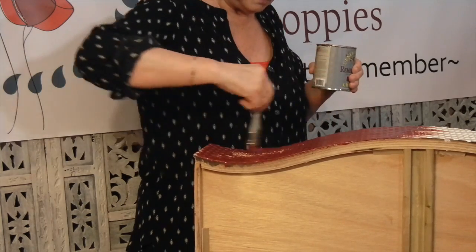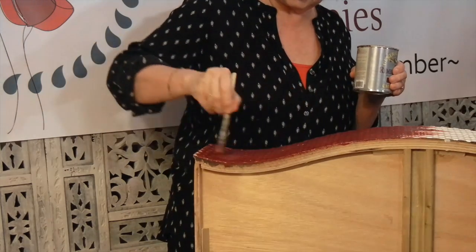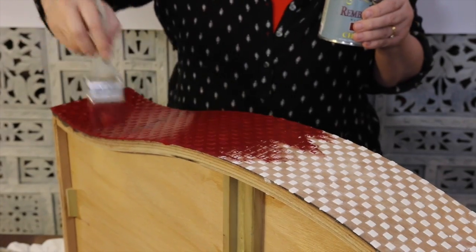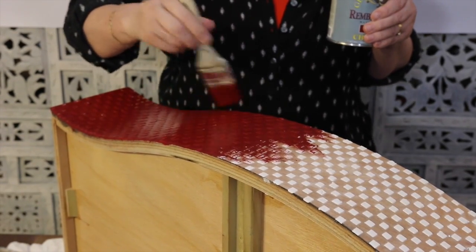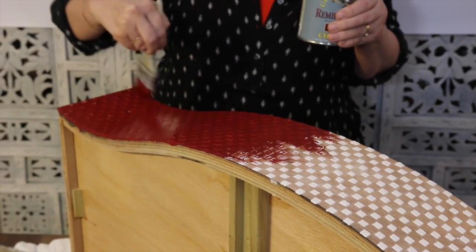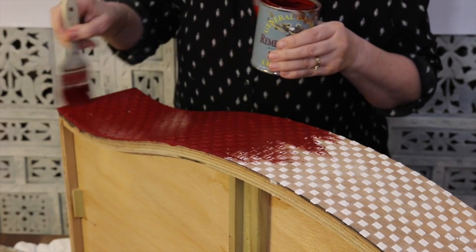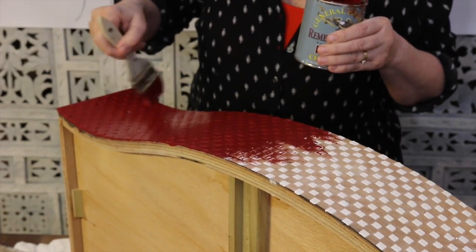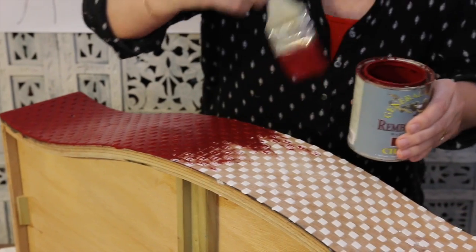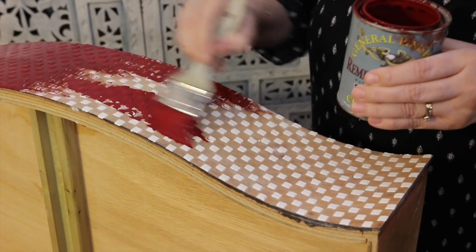I love this colour. Now when this is dry, I'm going to put a glaze over the top - it's called pitch black glaze. And because this is a chalk style paint, it's very, very porous. So if I put a glaze over this, it'll drink it all up and it'll do it in a quite random fashion and I won't be able to manipulate it at all. So when this is dry, before I do that, I'm going to put a top coat on - a varnish. And it means that when I put the glaze over the top of that, I'll be able to move it around a lot easier.